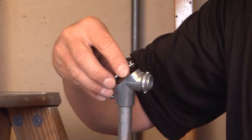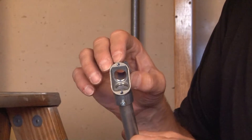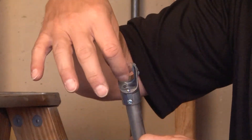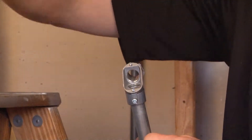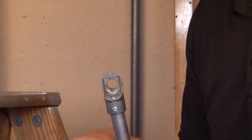You can then remove the cover, which gives you open access to the inside of the conduit so you can pull your wires through, then re-insert and pull the other direction into the box or enclosure.